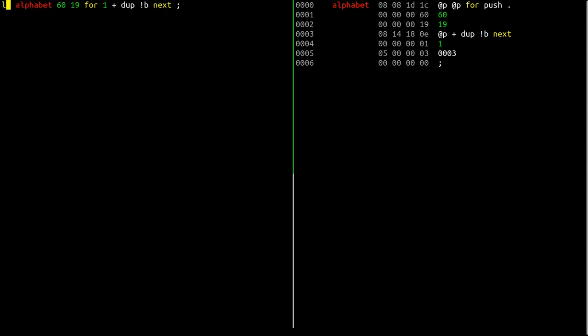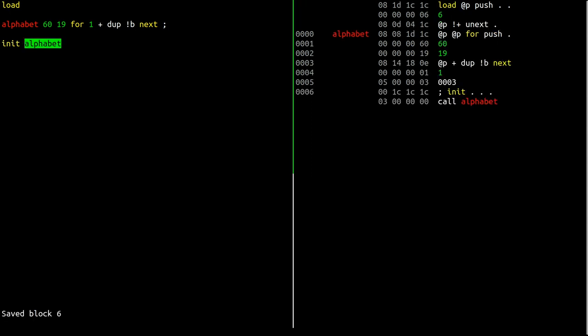So it appears that this program is already in memory. It's been given addresses by the assembler. But what actually happens is this gets written to block 0, and the machine boots with the P register reading from block 0, just streaming code in one instruction word at a time and executing them. If we want it to actually end up in memory, we have to use this load macro, which inserts this little program that loads the rest of the stream into memory in the F18.